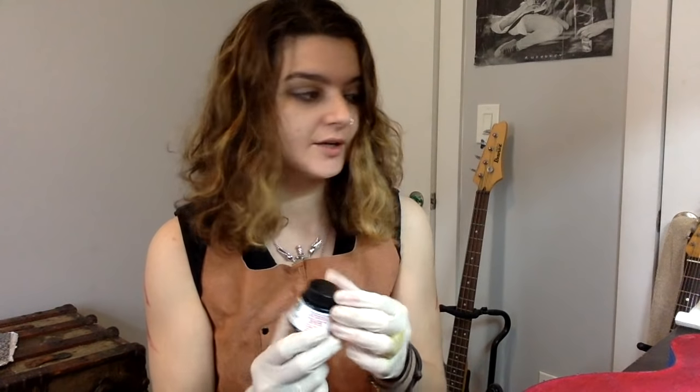From my research it appears that people staining wood with black leather dye are seeing more of a silvery finish, so I definitely wanted to go with a solid black. When you are staining a guitar with these dyes or inks you can either mix them with a solvent or with water — they are water based. I'm going to be doing a combination of the two. Water raises the grain and takes longer to dry; solvent dries really quickly and doesn't raise the grain as much, so I want a happy medium.